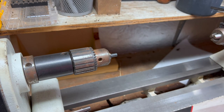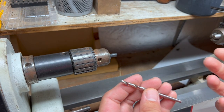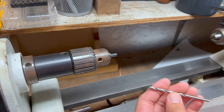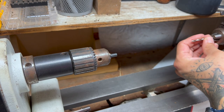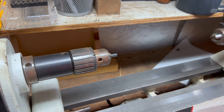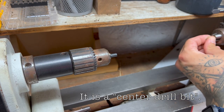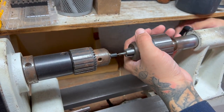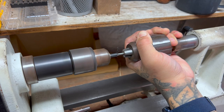Drill. So I'm going to use a stubby drill bit for this one, just because you want it to have less flex. You want it to be nice and rigid, stiff here, so we don't want it to bend and risk it going in at a different angle. My bad, sorry. First we're going to use one of these. This tool, I'm not exactly sure what it's called. It's been a long time since I ordered it. But it essentially just gives you a starting place for your drill bit.